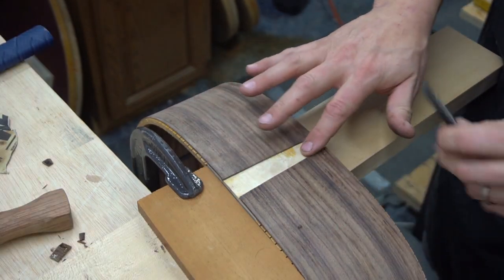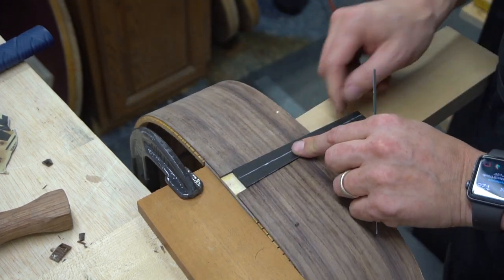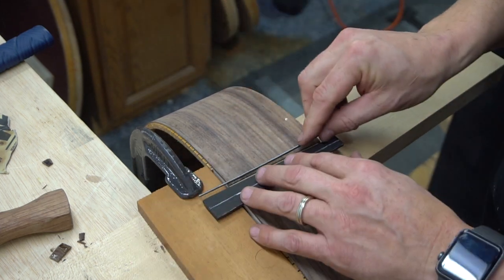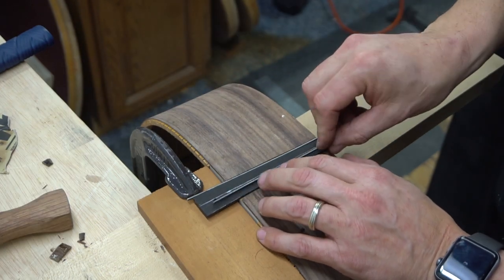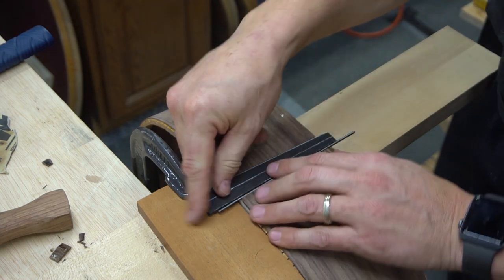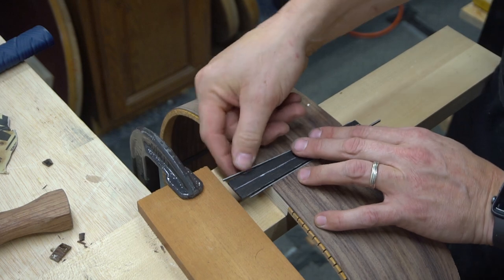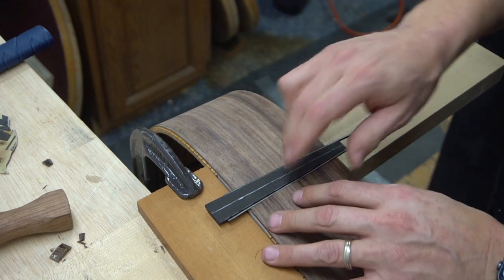Now I've got this wedge pretty much cleaned out. Just to do a test fit — well, if I was only doing the wedge I'd be in trouble, but I accommodated for that. I needed it deeper because I need to put purfling strips in — one on each side. That's a pretty good fit. We're nice and tight on both ends. Yeah, we're set. Now it is time to glue this in.